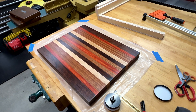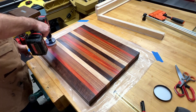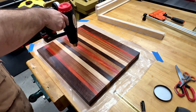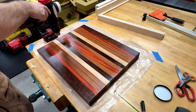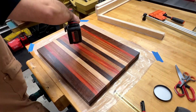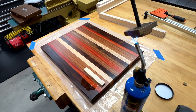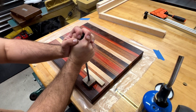Last, I like to get some — I guess I don't know exactly what it's called, but we'll call it a type of Brillo pad — and I throw it into my drill and just buff it really well, really working that wax into the wood fibers. I even heat it up with a heat gun. It's my own little trick to help impregnate that wax deeper into the board. Then I just keep buffing and polishing it until I'm satisfied, and then I wipe off the excess. And of course I have to burn my brand in, because I am a woodworker, and this is what we do.